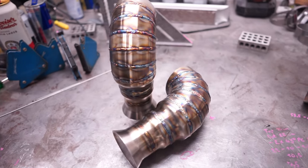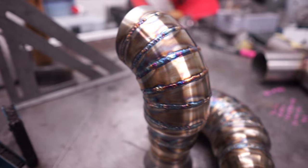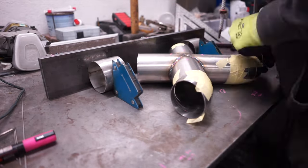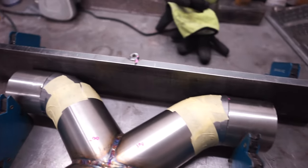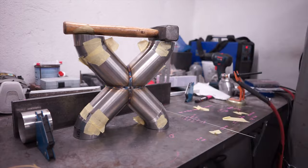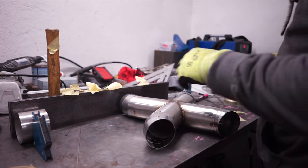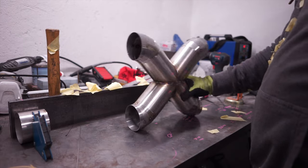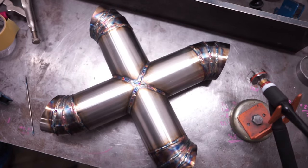The finished bends came out rather nice. I'm well aware I'm not the best welder in the world and my consistency needs a ton of work, but I'm good with that — I'd rather learn. Following that I needed to finish up the X-pipe with all its 45-degree bends. To get it all squared up I set up a thick piece of steel perpendicular to the working surface, which helped me fixate everything in place until it was aligned flawlessly. I should mention: welding and working with pie cuts is tedious. It takes ages and costs much more than regular bends — not just material, but additional gas as well. However, I'm getting two specific things out of this: one, even though it will be hidden beneath the bumper, I know it looks absolutely wicked; and two, I'm getting a ton of welding practice out of it. That's good enough for me.